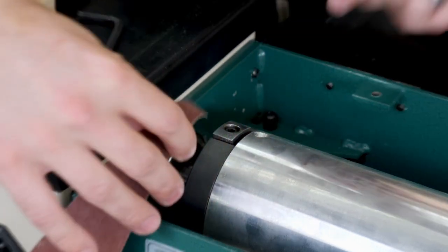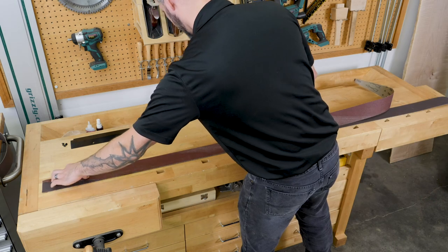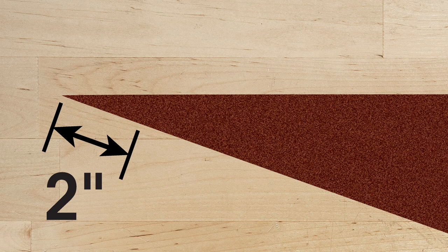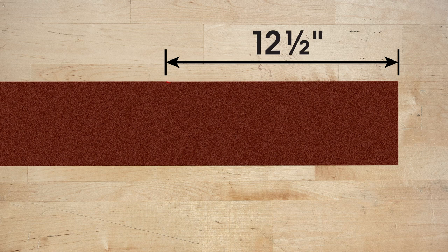Use the old sandpaper as a template to draw and cut the new sandpaper strip, or you can pause here and use these dimensions to get the correct fit. Cut a length of sandpaper 86 inches long, then measure 12 and a half inches from the end and cut from the corner to the 12 and a half inch mark. Next, measure from the corner two inches along the cut edge and make the next cut at a 90 degree angle. Repeat this cut layout on the opposite side of the sandpaper strip, but mirrored.